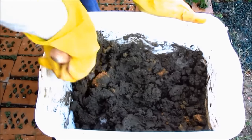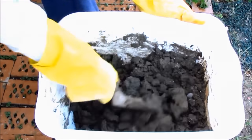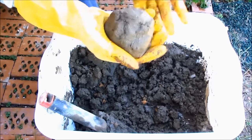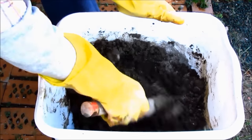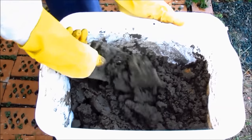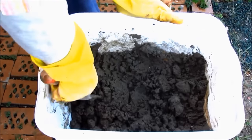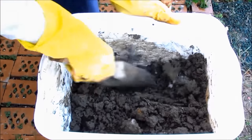If you're making something that you want your cement to hold and not run any, you mix it up thick like this right here. Like it will stay just balled up like a ball. But you don't want it where it'll run through your fingers and run off. When you pour in a mold, you can have it thinner, but when you're making something that you want to stick and hold up and not run off, you have to make it thick. This is stuff that I've learned making up my cement.